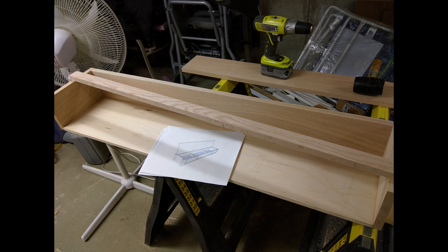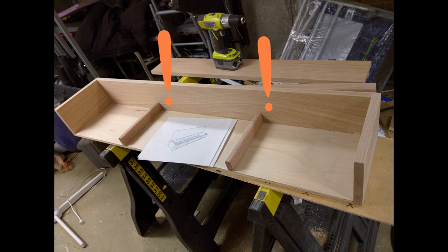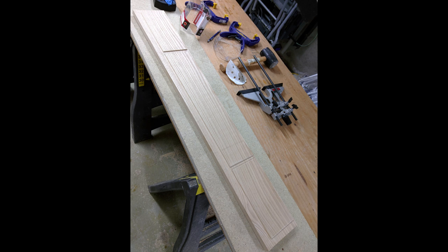This is the start of building the carcass. The back panel and the bottom were pretty much just butt joints, because I felt I didn't need any more than that — the design was pretty simple. There were a couple of rabbets in it from the manufacturer, so that's what I decided to go with. Here you can see the two oak center dividers I put in — those will just be compartments. This entire project is oak, with the exception of the bottom. I used plywood, because it was going to be covered with velvet anyway.